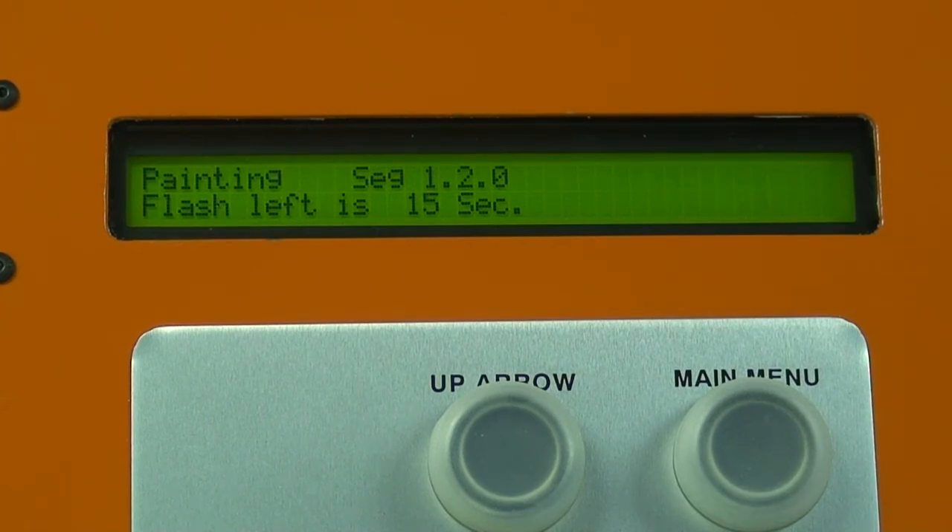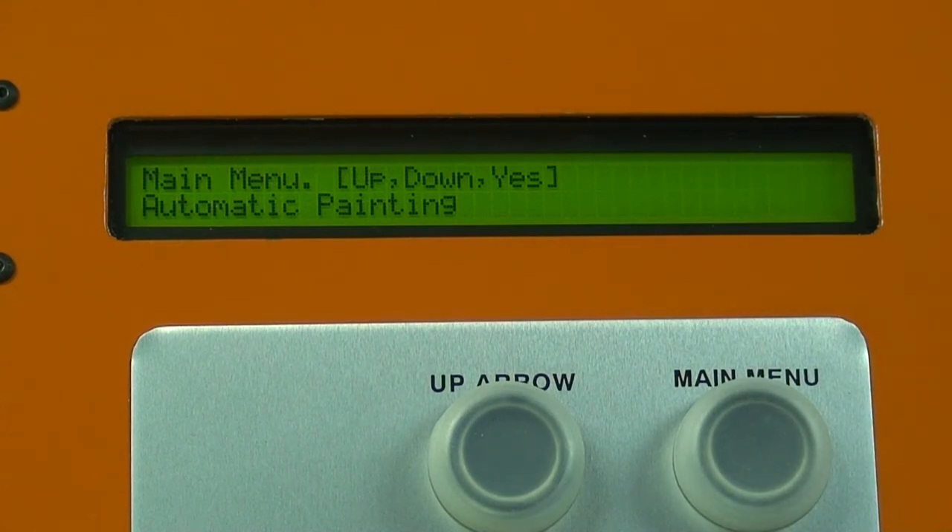When the flash countdown reaches zero, the motion and spraying will start again for the second coat. That was the last stroke — the vertical index is returning to its bottom home position. The machines have a panel loading position which is slightly higher than the bottom position to make it easier to load and unload the panels. Then the machine asks if you want to clean the spray guns, which is very similar to the test function. We're going to say no, and the cycle is finally complete.